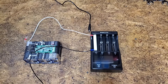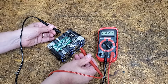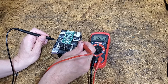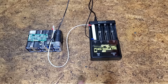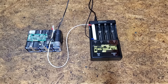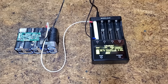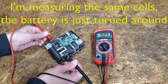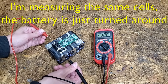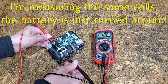Now all 4 bars light up. However, when checking the cells individually, I found 2 that were still not charged. Since the banks can be measured using the tabs on top, I assumed the whole bank would charge together, but that's not the case. I connected the wires to the top cell and set the charger to 2000mA — I figured these larger packs were made to be charged faster, and didn't notice any heat from the higher mA. When finished, I realized why the larger pack took so long to charge. By connecting the wires to the top cell, it also charges the cell directly under it. Now we should be good to go.